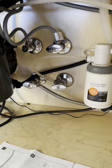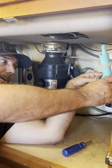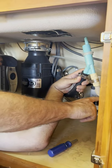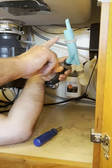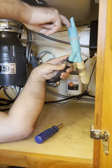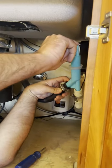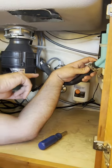I got a mix match because I'm a plumber and I just used what was in my truck. So we got the air gap out. How the air gap works — it's kind of an interesting idea. The intent is so that food doesn't end up back in your dishwasher. Water from the dishwasher comes up this hose, up to the top of the sink, comes up through the middle here, hits the top of that piece that we took off, goes back down here into this black hose, and then into the garbage disposal. It's called an air gap because there's a physical gap between where the water comes out. That keeps it safe.